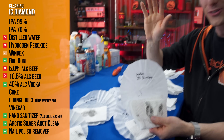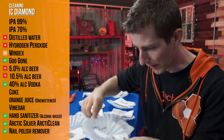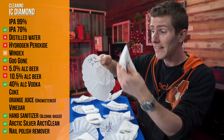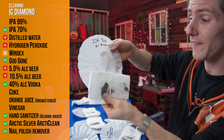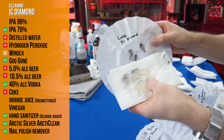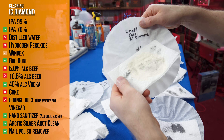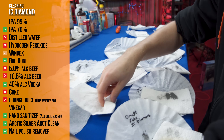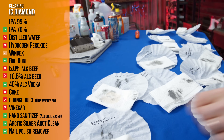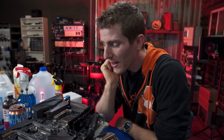Vodka: if you gotta clean your CPU with alcohol, go with the vodka, not with the beer. And our isopropyl alcohol — I think we've put an end once and for all to the debate of 70% versus 99%: doesn't frickin' matter. Coke was basically tied with water and you get kind of a urine-stain-looking thing on your paper towel. The same goes with orange juice, except even more. Vinegar worked actually much worse than expected, barely removing any of it. And the golden standard: isopropyl 99%.